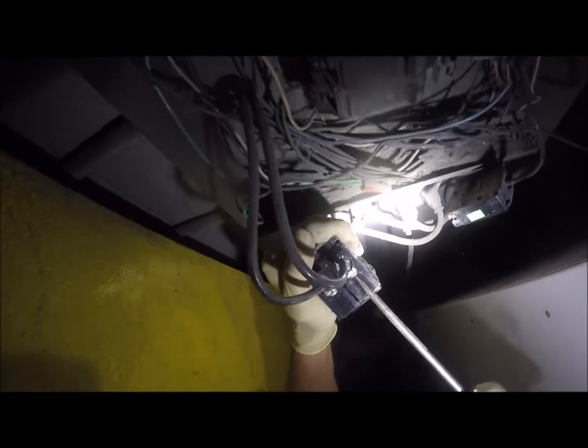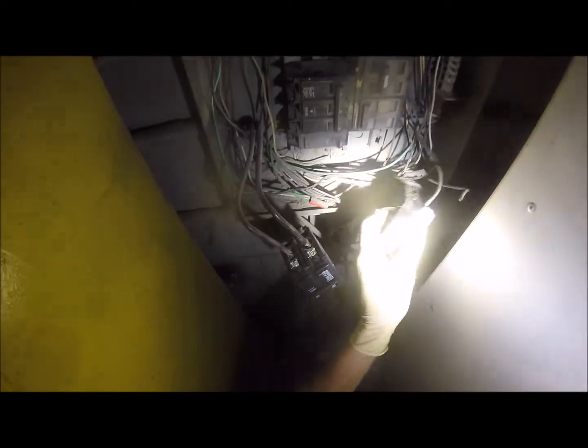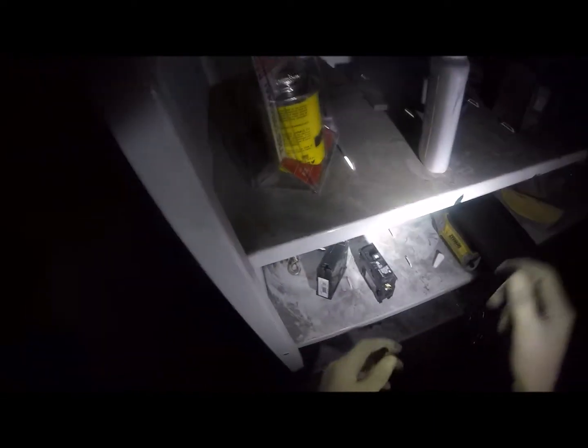Okay, so there's a new 60. Make sure those are nice and tight. There's a torque rating on these, but I'm not gonna worry too much about that. Style type NP. These only listed enclosures, made in USA. Yeah, that's definitely 60. Okay. The other one here, this one that's fried, was a 30. Let me pop that one. And the wire that I got right there that's cut was actually the one I took for a sample. That's a 20.